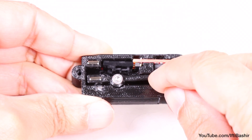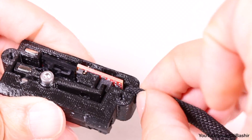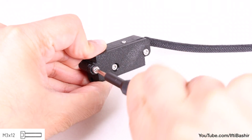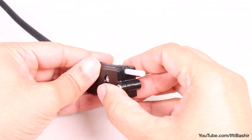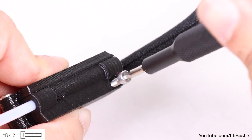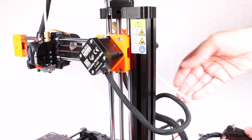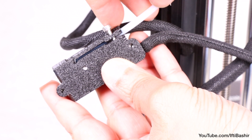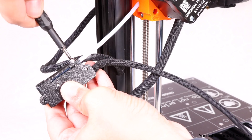This is an important step as otherwise the sensor will not work. Once verified, wrap the textile sleeve around the filament sensor cable and slide it into the box as far as possible, before placing the cover on top and securing with two M3x12 screws — we're going into plastic here, so just tighten enough until snug. Onto the included small PTFE tube now, which is inserted into the sensor assembly on the opposite side to the textile sleeve as far as it will go. Which end doesn't matter as both ends are chamfered. Next, insert and slightly tighten the M3x12 screw — do not tighten all the way just yet, it will be tightened later. Slide the longer filament tube from the extruder into the sensor assembly from the opposite side, just above the textile sleeve. There is a groove in the side where we can check how far the tube has been inserted — it needs to go all the way into the end of the groove, as otherwise the sensor will not work correctly. After which we can tighten the screw gently to ensure the PTFE tube stays in position and doesn't slide out with use.